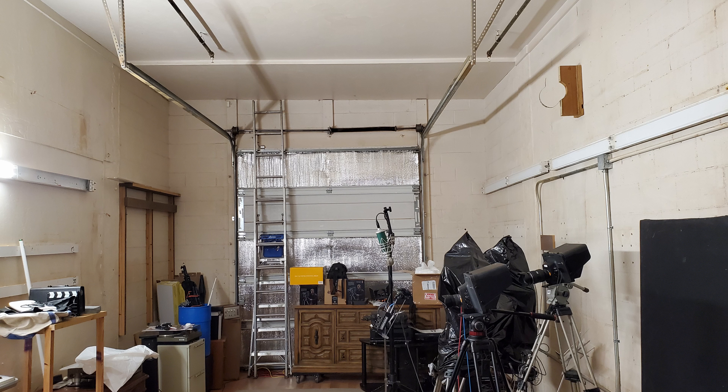Since we're not starting from scratch and we're kind of stuck with the existing outside walls, this design has a lot of compromises. As you can see here in this picture, this is actually the original garage door where the tall RV would be coming through. This is going away and we'll be putting a window in place of that. We're putting up cinder block to fill that all in.